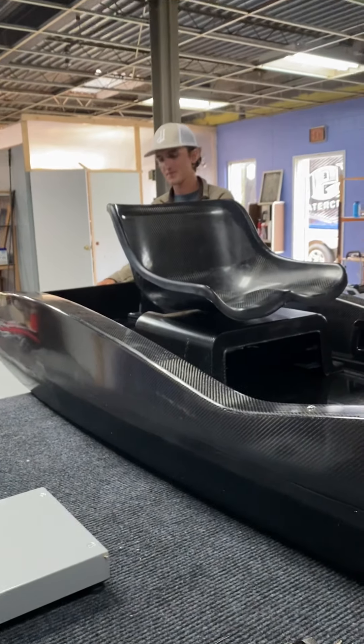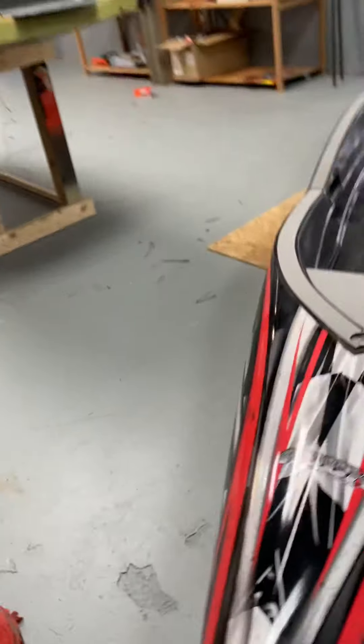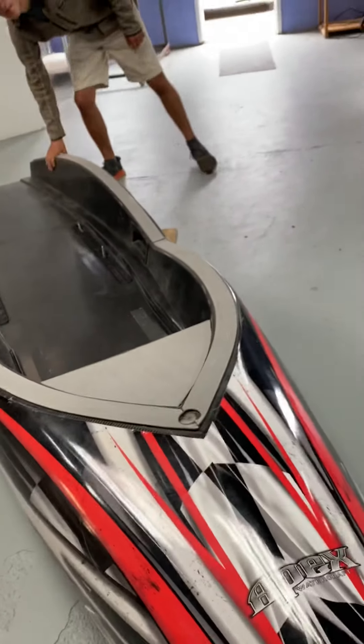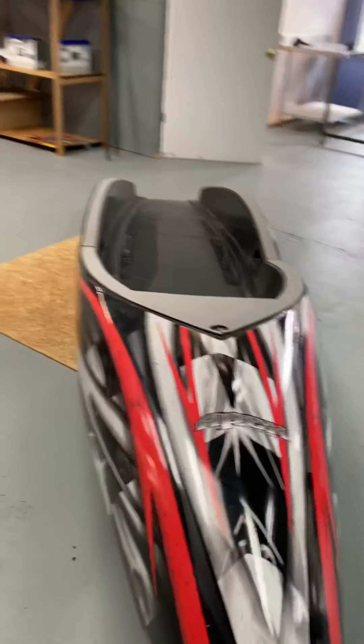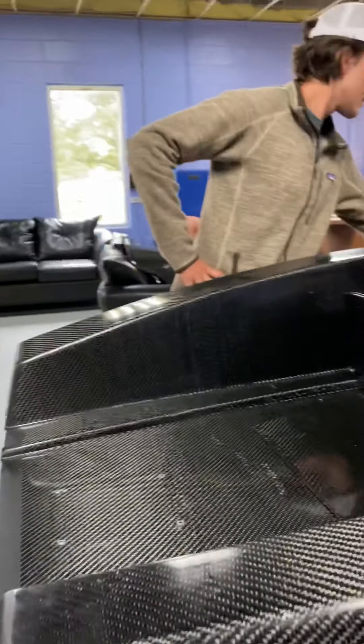We're putting a little bit extra coating on the stern where we drag. This is my boat over here — I've been using it. Second Lake Wheeler, there were 50 portages, and this is me portaging it. This is a paracord braided grab handle and I'm dragging it around like this. How come? Because it's got abrasion resistance under there. Now, can you eventually wear through? Of course you can. So do you drag it on blacktop all the time? Try to avoid it when you can. Drag it on grass, over logs — no problem. It's lightweight, it won't self-destruct. That's what this thing is designed for.